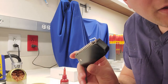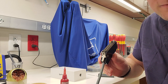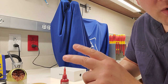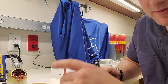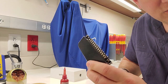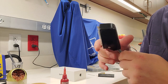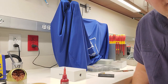One final step — the most important step of all — is to take the newly repaired foot control down to a microscope and give it a full function check just to be sure. Make sure you press more than one button at once, like focus and zoom and the head release to move the head around. Test all the functions in all different orders to guarantee that all the wires are connected properly and that the cord wasn't damaged internally. Thanks for watching — this has been repairing a Zeiss Microscope Foot Control. Hope you liked the video.